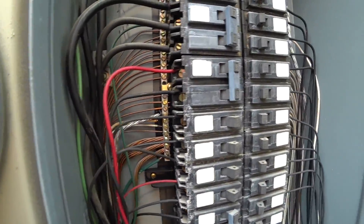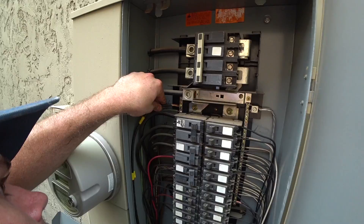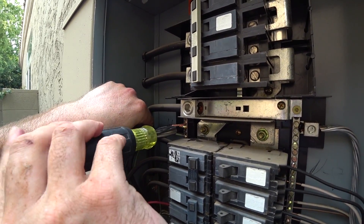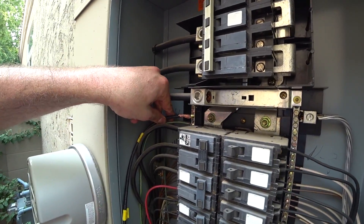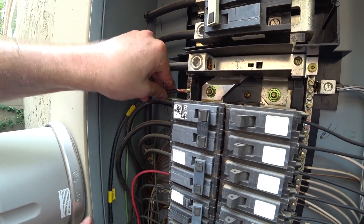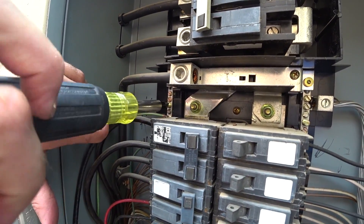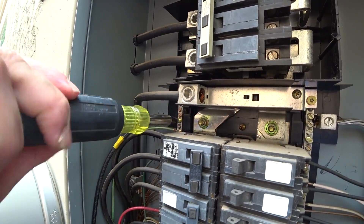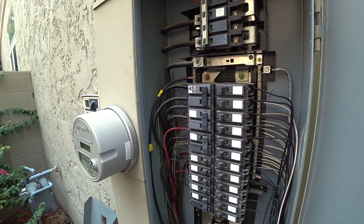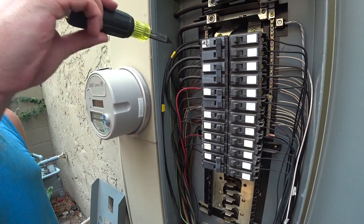You can see over here you've got the green side, the white side, and those two hots go like this. You probably already have a breaker in your box that looks very similar, so just copy it. So that just clamps all those wires down — it's just a screw with a hole, that's all it is. Sometimes you get wire that's a little bit bigger, and if it's too big to fit, you can clip out a row or so. And like this rubber-handled screwdriver — if you use one hand and keep the other hand free, if you slip into something on accident it won't shock you, because you're not grounded.